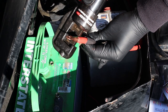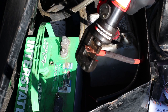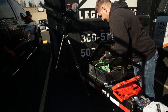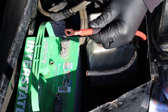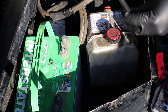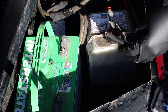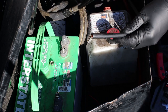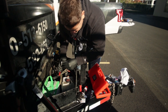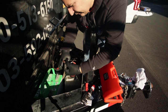We go ahead and put the wire in and start crimping. One more squeeze — that's got to be tight. Open it up and look at that — solid crimp. That's one down. Now we do the other wire — you can use a razor blade to cut back the insulation a little bit, figuring out how much to expose.